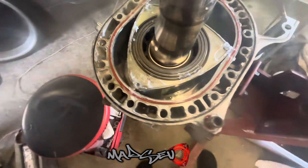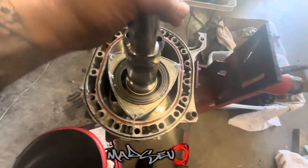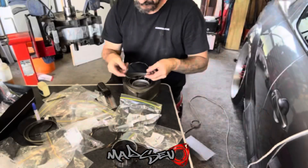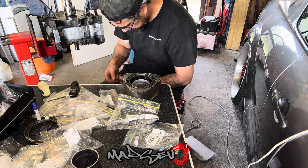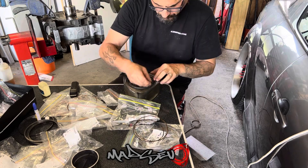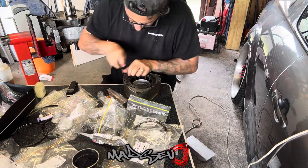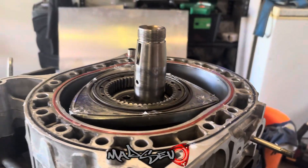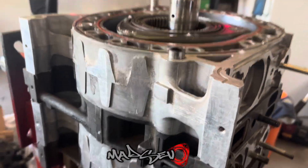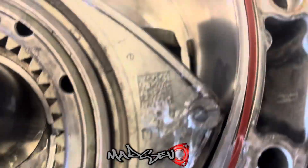Just about ready to close up the first housing — all the seals are in. We'll just keep carrying on stacking it. So far so good, it's looking good. Just gone ahead and reglued the apex seals and I'll slide them in here, then we're good to close this up. You can see in there how far that bridge goes down — it'll definitely overlap in this.